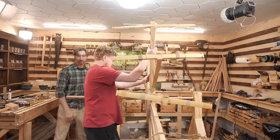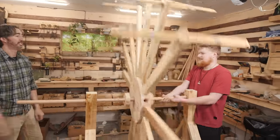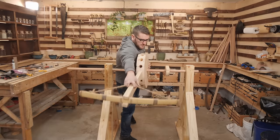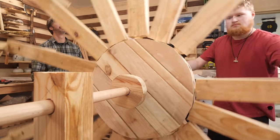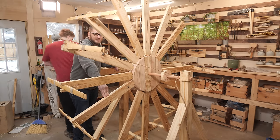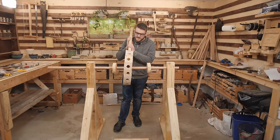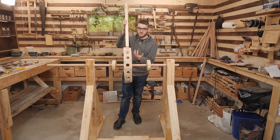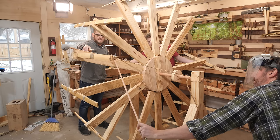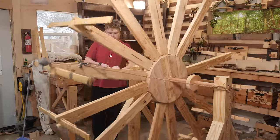It's a little bit of arms manufacturing to make 16 of these, which makes it kind of absurd — because we have 16 basically working crossbows, you could just get 16 people and shoot them at once. As it spins, a rope attached to each of these will connect to the drawstring. As it wraps around, it'll pull it back. The challenging part will be when it actually fires — there's going to be a lot of fine-tuning to determine which angle in the full wheel it'll actually fire. Da Vinci's drawings are a little vague, so it's not super clear exactly how to do this, but hopefully we can figure it out as we put it together.